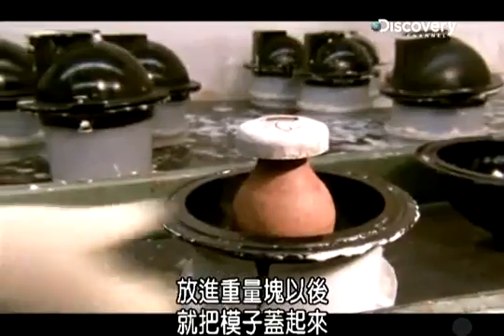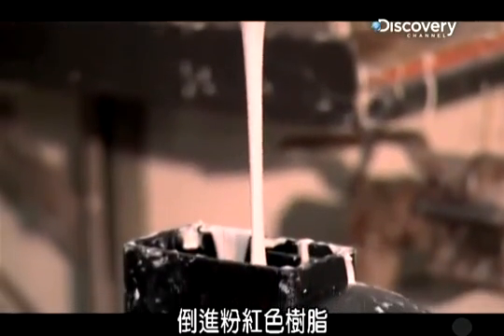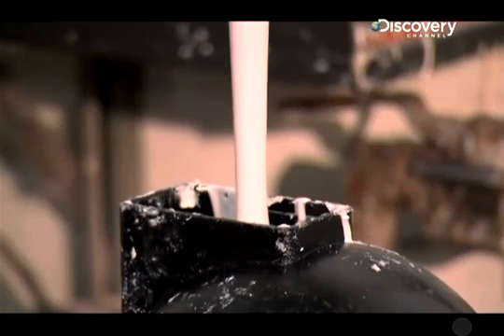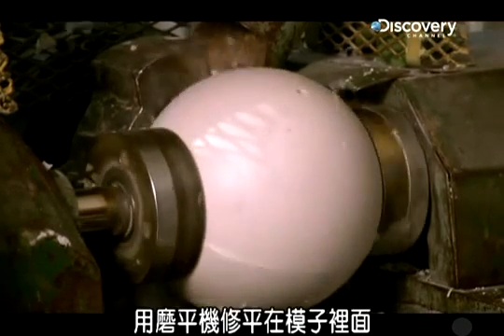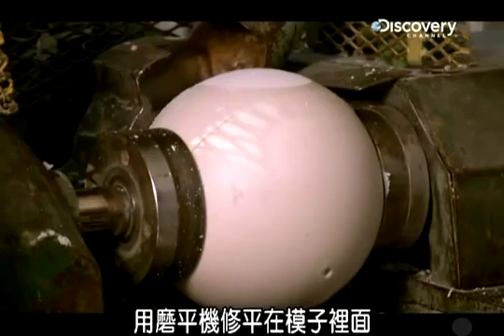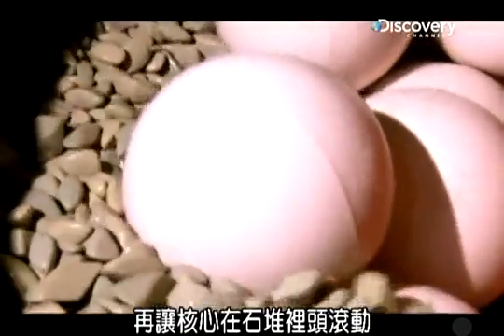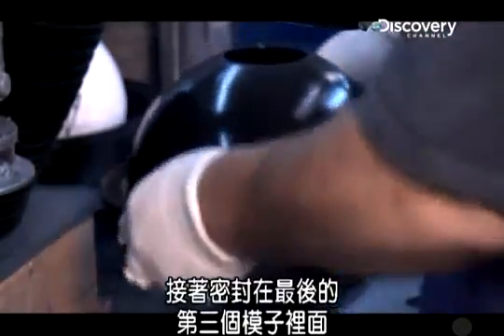When the blocks are in place, the molds are closed up and the pink resin pours in to completely fill in the space around and under the weight block. When the cores are dry, a de-knobbing machine shaves off the irregular knobs or rims left over from the molds. Then the cores take another tumble through the rocks to smooth out their surfaces before they're closed up in a third and final mold that forms the ball's hard outer shell.